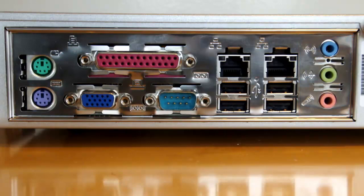Though this box does have a multitude of connections, only two are absolutely essential: the 9-pin serial port for configuring the device, and the left network interface port for connecting the SA5600 to your network. This interface is network port 1.